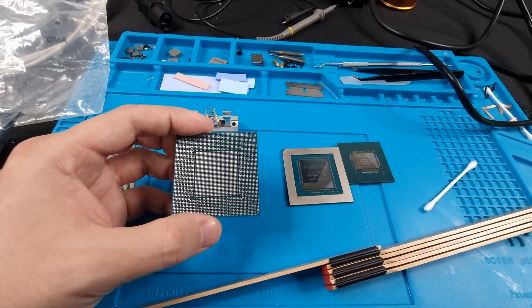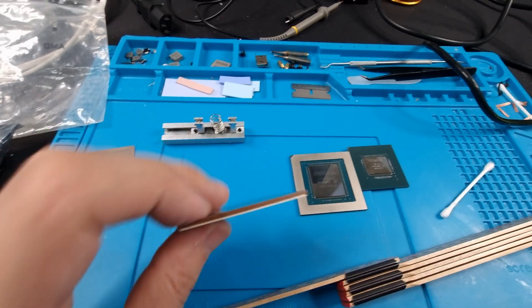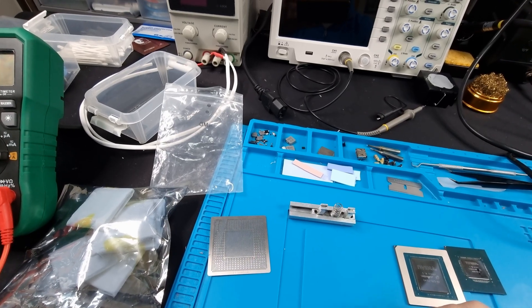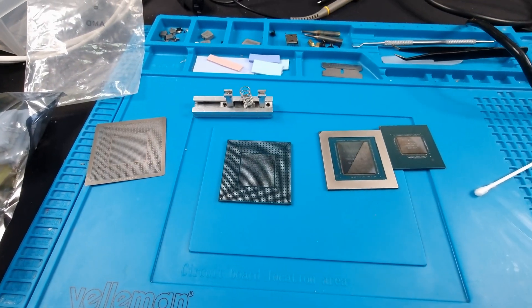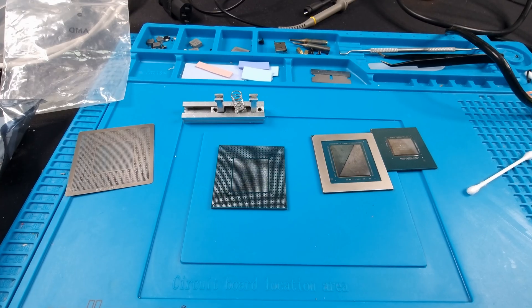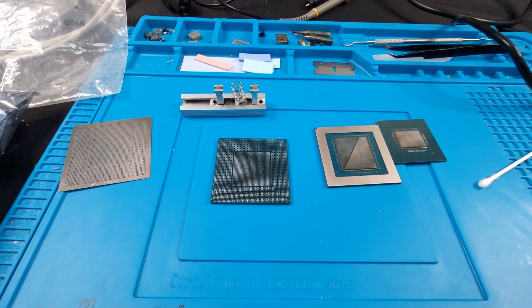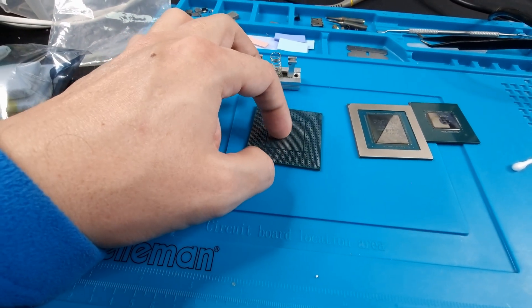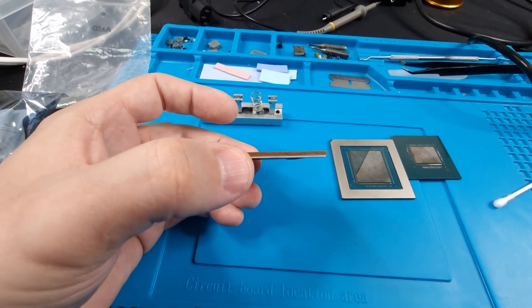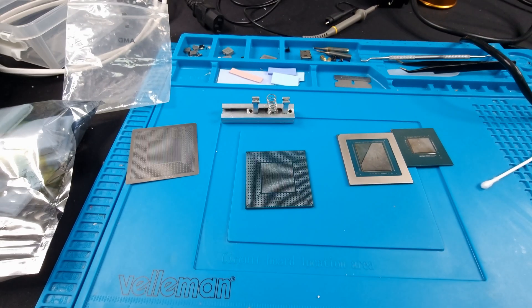Anyway, that's not the topic of today's video. This core — I'm gonna have to throw it away because it is so badly deformed. That was it — just a rant about sagging cards and what happens not only to the board but also to the GPU cores. They do bow, and when that happens they become either unusable because pads get ripped from this area, or they just become bowed really bad like this and that becomes a problem. Alright, see you guys in the next one, take care, bye bye.